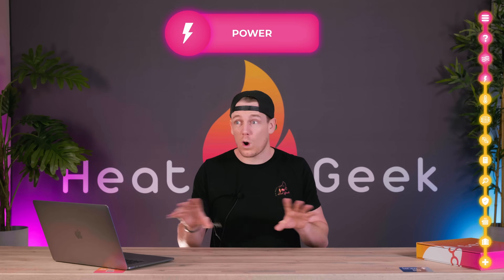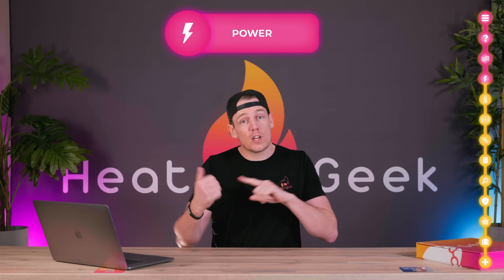To work out exactly how much power you need in your home, or even one specific room, grab our cheat sheet over on heatgeek.com. Simply multiply the room that you're heating, or the whole building, in metres squared by the relevant watts per square metre. You can also watch a video on how to size your heat pump — I'll drop a link in the description below.